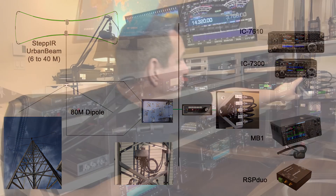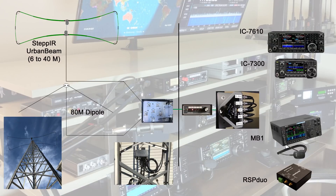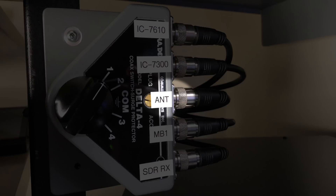That one coax goes into an Alpha-Delta switch here inside the shack. Why this type of switch? Because they are very, very well isolated, and every time you select an antenna port, the other ports go to ground as well. So I have all my HF antennas coming in from outside, going into the switch outside, and only one cable for all the antennas coming into the shack. This cable goes into the Alpha-Delta switch on the antenna port that you can see here.